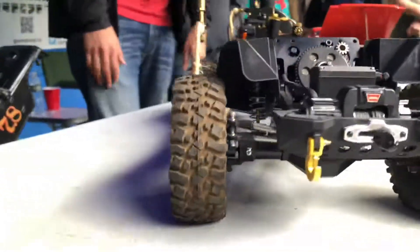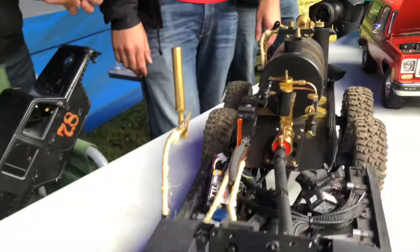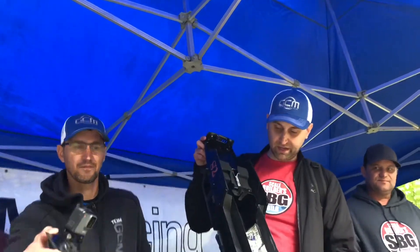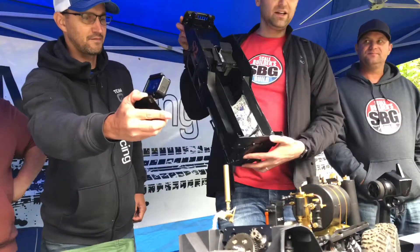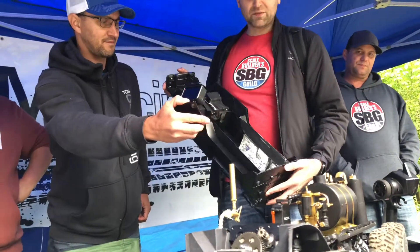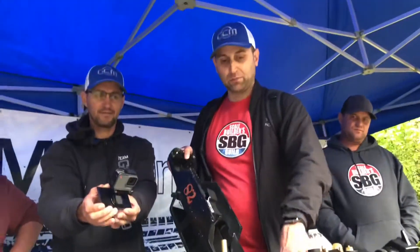And there's a whistle that works. It's just like — could it work? The answer's sort of. Was there anything specific that was really challenging? Figuring out how not to melt styrene every time I fired it up was challenging. The interior has a whole bunch of Nomex and reflective tape in there just to cycle the heat back towards the engine. But everything else was pretty straight ahead — these engines come pre-assembled. I just had to do a lot of my own plumbing to get the steam to go where I wanted it to.